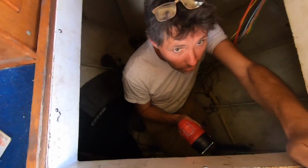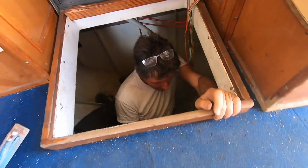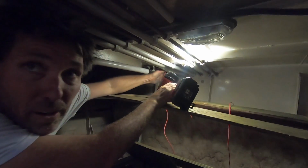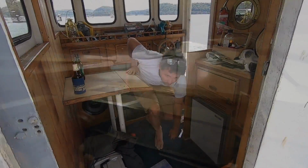So, do you want to maybe just pull on those wires a little bit? Yep. And see if I'll see any movement here? Sure. They're pretty well pinned. Is that the black wire coming down now? It is. It's definitely red and black, and I had a bit of slack in it, so I'll see if the slack's been taken up. Yep. Yeah, that's definitely it. So, the black wire just goes back into the engine bay, and the red wire is just loose here.